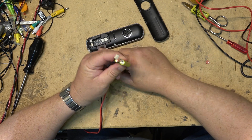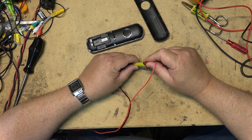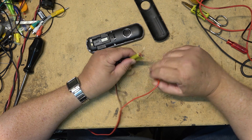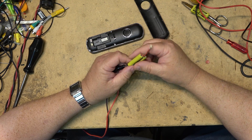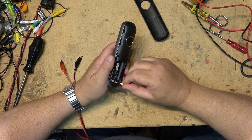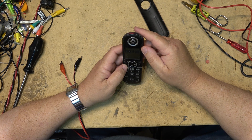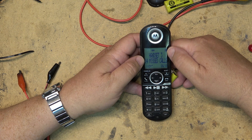So we may have actually fixed it just by jolting that one cell. I'll do the other one just for good measure — give this one a bit of a jolt as well. It only takes a few seconds. You don't want the battery to heat up, because if it does it's going to pop the cell itself and blow the safety seal that will vent if it builds up too much pressure. If you cause that, you'll ruin the cell — when it cools down it's going to suck moisture in and short the cell out.